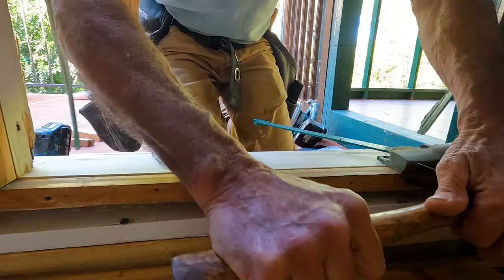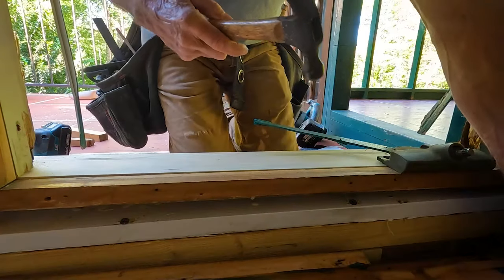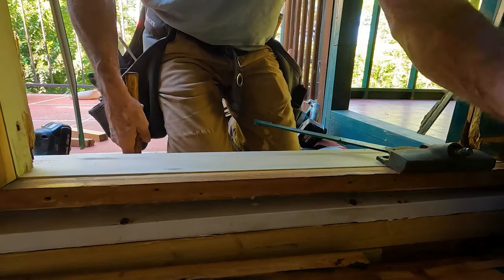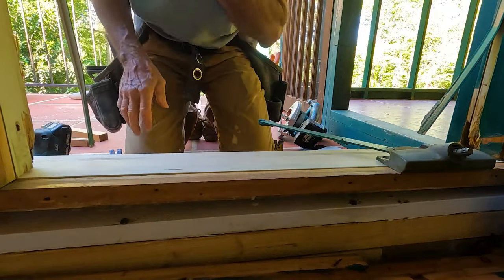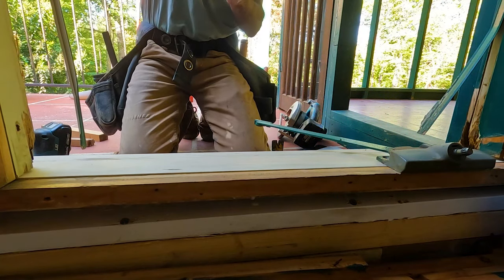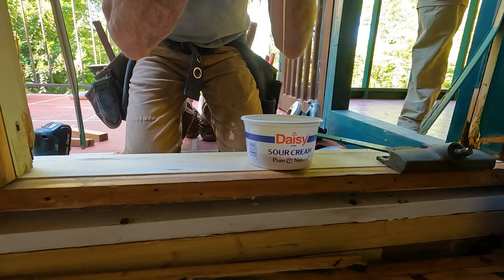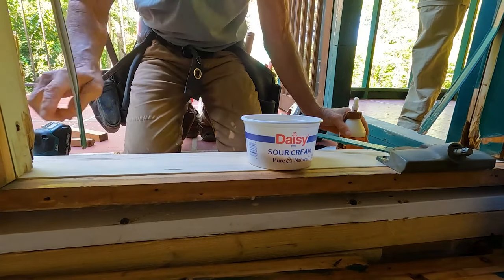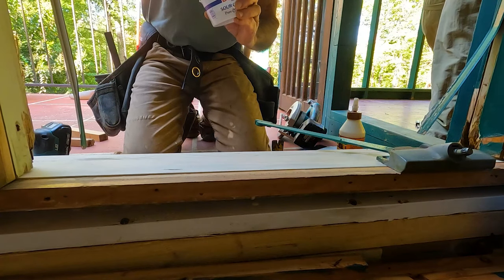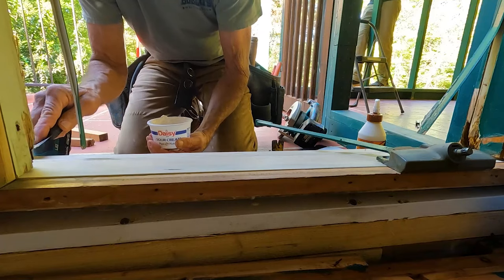It's because they're thin and small. I'm not really a finish carpenter - I'm not a carpenter at all actually. I'm a hack. Let's try this big old nail. Okay, nice noise. Now what we need to do is take the sawdust and mix in a bunch of glue so you get that nice paste. You put a bunch of glue in there and it makes up like a paste with the sawdust. For filling big stuff like this - that's cool - you've got something to sand that looks like wood, because it is wood. Then we can force this down into these cracks here.